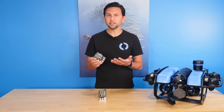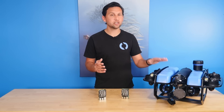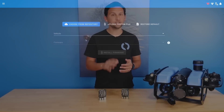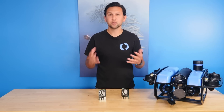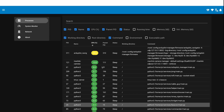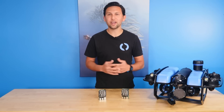Along with the hardware, we've put a lot of effort into our new core software, BlueOS, to make the Navigator easy to use. BlueOS replaces the companion software on the ROV and is a collection of tools and features unified through a clean, browser-accessible user interface that makes using the Navigator a great experience for users and for developers who wish to build capabilities on top of it. BlueOS, which is built on top of Raspbian Linux, manages the computer hardware and the services and features that run on it, including network configuration, autopilot software, software updates, communication, camera and video streaming, and user-defined extensions. There's a lot more that will come in the future of BlueOS, but this is where we're at for now.